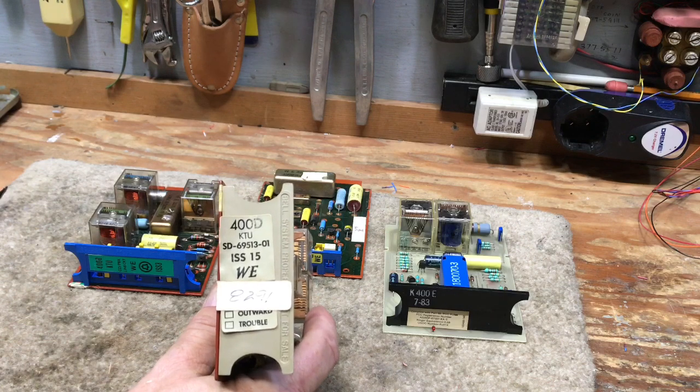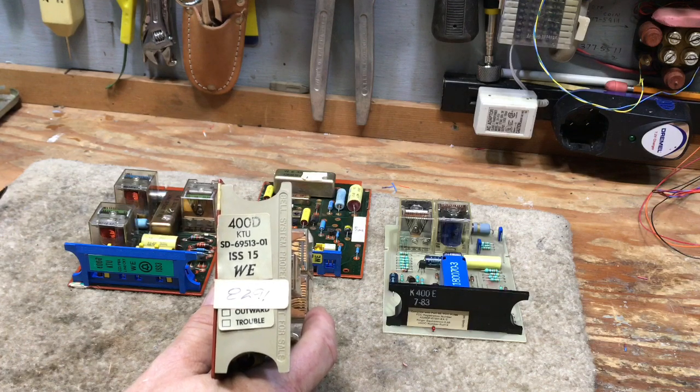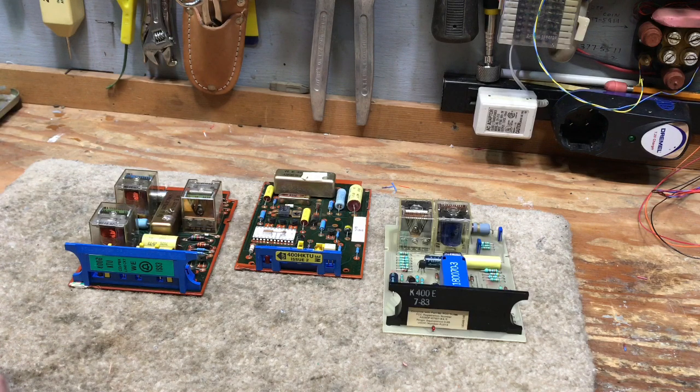These have the ring-up relay circuitry bridged across the phone line. With your ATAs and VoIP type systems and some digital PBX systems, the ringing is across the tip and ring pair, the 2-wire phone line from the phone company. The 400 series prior to issue 15 needed what was called grounded ringing in order to complete the ringing circuit. ATAs and some electronic phone systems are not connected to earth ground directly or from a circuit standpoint. The chassis may be grounded, but the internals of the unit will not be grounded to complete the loop.